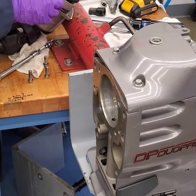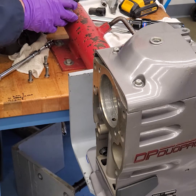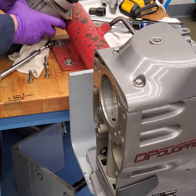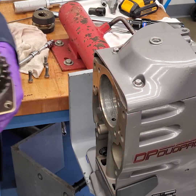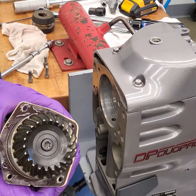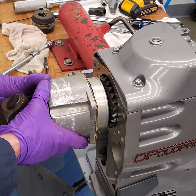Putting the plastic shims — the original ones — back on here because I still have those in stock. The ones you will probably use are stainless steel, so it's going to look a little different. The shims only fit one way. There's a slot on one side, and it is larger on the top than on the bottom, so it's not too hard to figure out.